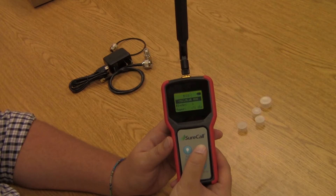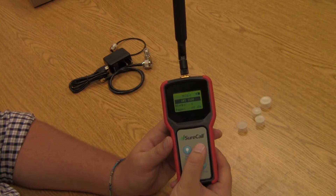We also have Cellular, which is where a lot of the 2G and 3G data and voice is going over. PCS is another band that carries a lot of 2G and 3G voice and data — so a lot of your text messages and voice calls are going over either Cellular or PCS. AWS is 4G capabilities primarily for T-Mobile, though Verizon and AT&T will sometimes use it as well, making it a 4G signal band.